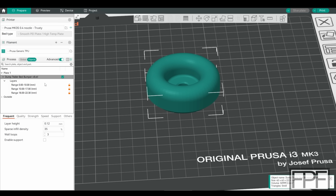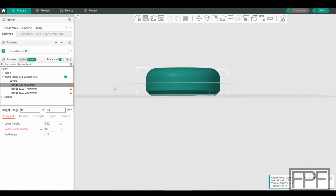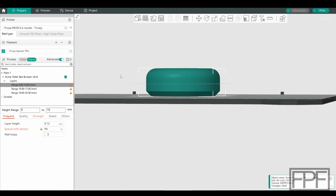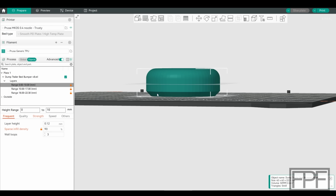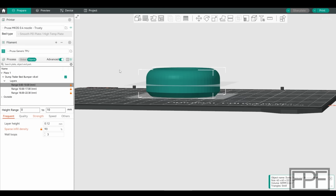And I've actually added 3 of them here. So I've tweaked not just the infill, actually. If we look at the bottom, we have 90% infill, and it's showing us a kind of cut there. This lower part is almost the overload part of our spring here. That is where it is going to take a tremendous amount of force to compress this bottom portion because it is 90% infill. So it's going to be quite strong.